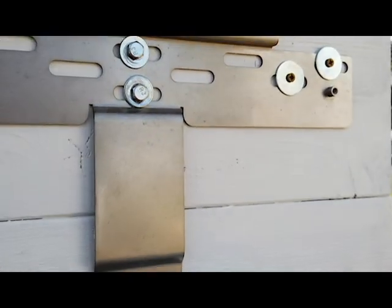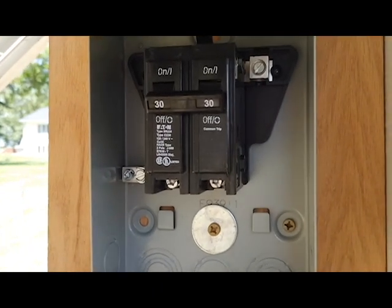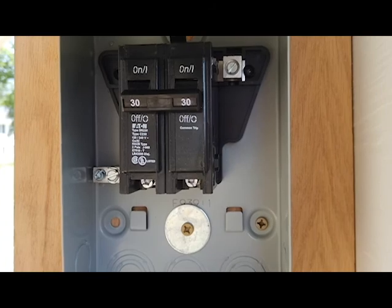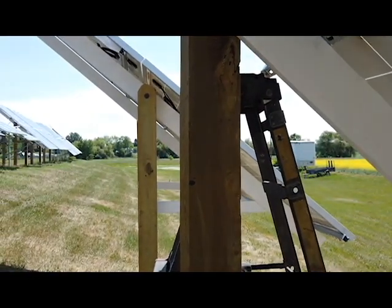And the bracket to hook on the inverter and bolt it down. And I come around to the DC disconnect that I'm putting right behind it. This is a 30 amp fuse because I'm going to be running number 10 wire, even though it'll never get up to 30 amps. These six panels right here — there are 12 all together. There are two ground mounts that I'm just putting in.